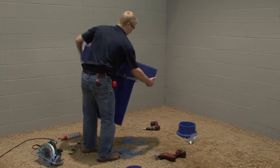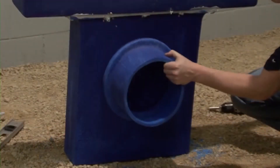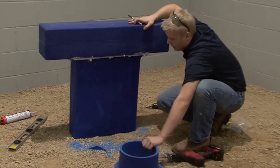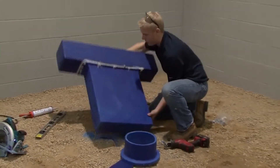Set the assembly in the trench and determine where the lateral run is going to meet the face of the linear diffuser adapter. Then mark the spot where the duct meets the plenum adapter box on the linear diffuser adapter — this is where you will attach the plenum adapter.